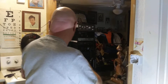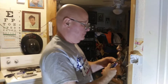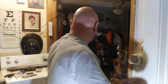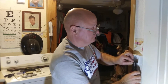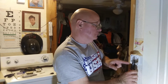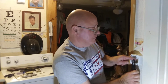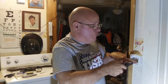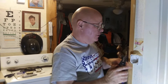We're going to have to clip and strip our wires. I'm going to make sure I'm in the 14-gauge hole here. Over there they use 1.5 square millimeter, so that is very slightly smaller than our 14.